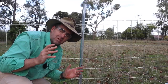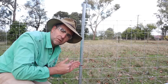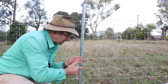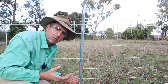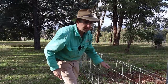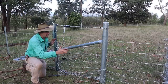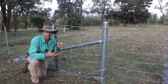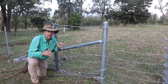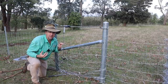Now when you've finished straining you want to do a couple of checks. The first one is you need to make sure that the picket wires are roughly in line with your straight intermediate posts. If they're not, just put a little bit more tension on the bottom or top and get the strain tension nice and even down through the whole fence. The next thing is use your leg muscles — walk the fence and make sure that it's not caught on anything and mucking up your strain. So now we're all strained up and all we've got to worry about is this two or three foot section of loose wire at this end. I'm going to show you a couple of ways of tying off to our end twitches that will ensure that this doesn't take away from the wonderful straining job we've done on the rest of the fence.